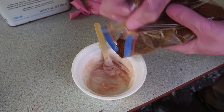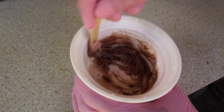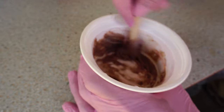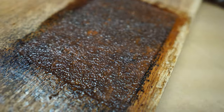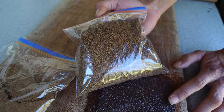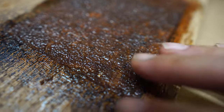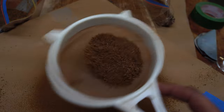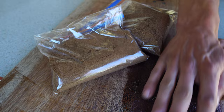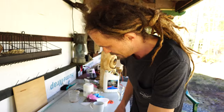This was my first attempt at filling with epoxy, silica powder, and teak sawdust. The problem was using the coarser sawdust from making teak plugs — lots of big chunks — which gave a really rough surface that needed sanding. So I strained out the really fine stuff to use as filler where I want it nice and sandable. I'll sand it down then make another batch to fill all the little holes. It's really solid — way more solid than the patches I was doing with wood filler — so I think this is going to be my go-to for filling.